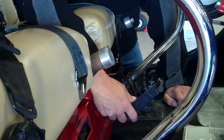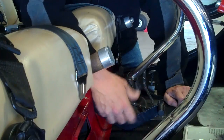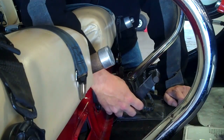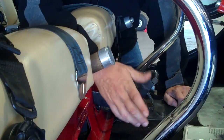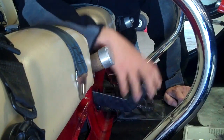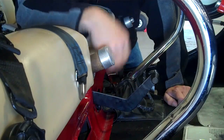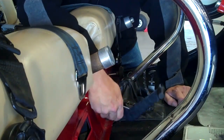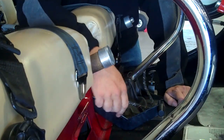I've seen it a million times — guys struggle with this thing because they get too rough with it. You've just got to know how to use it, be familiar with it, and mess around with it before you go out to fly for the day. So instead of having the stress of going through the checklist with the engine running and your instructor watching you, just bring it up nice and gentle, click it in, bring it up until you get the rotor where you want, engage it, take it back to the floor. Then when you're done, back up all the way to the top, pop it forward, back down to the floor.